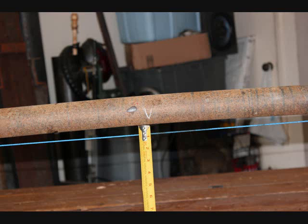It's not hard to bend this stuff. Words of advice: take your time. You don't even have to take as much bite as I did — you could do it in quarter-inch increments. I know that metal bends and it'll spring back, and I'm fine with that. The big thing is don't get crazy with it and you'll be satisfied with the outcome. Hope this helps — two ways to bend axles. Keep on doing that mad stuff in your garage, because people will talk about it. This week I bent metal with a 12-ton bottle jack.